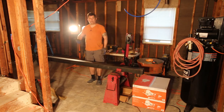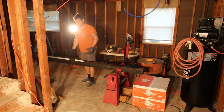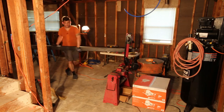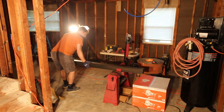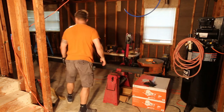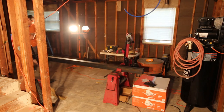I want the stand to stick out one inch past the end of the aquarium where the sump or overflow boxes are. So I'm going to flip this around and keep the factory cut because I think it's better than what I could do — I'm a little bit space constrained in here. This is a little heavy, so one of the things I do is wear gloves because the pieces of steel have a lot of oil on them. The oil protects the steel from moisture and prevents rust while it's sitting at the steel yard.